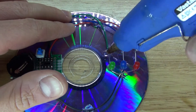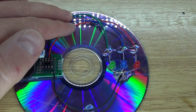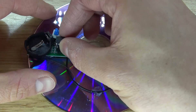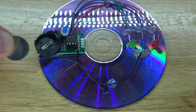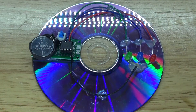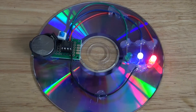Take some hot glue and glue down the wires and exposed leads to insulate everything. Then take the ATtiny85 and place it into the IC socket holder. Take the 3 volt button cell battery and place it into the battery holder — the circuit is now complete. Test the circuit, and it works. The LEDs are now flashing in a random order. The code is in the link in the description below to program your ATtiny85 to do this.